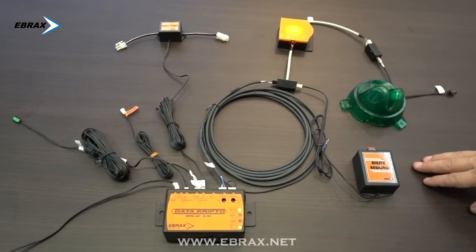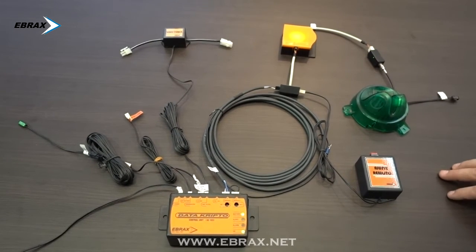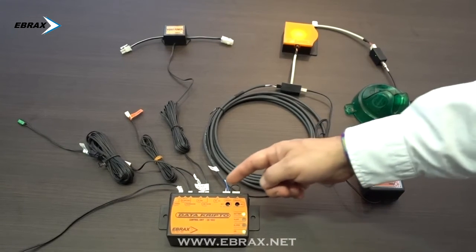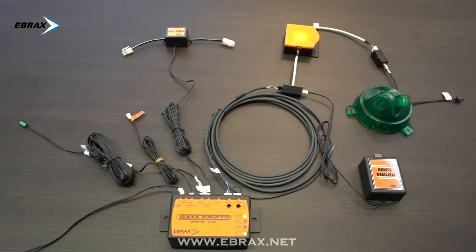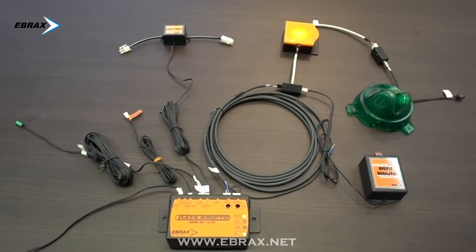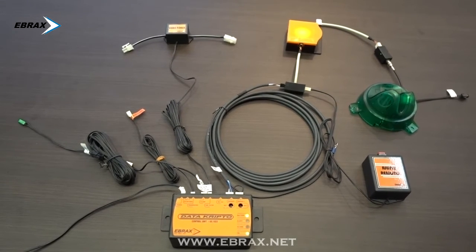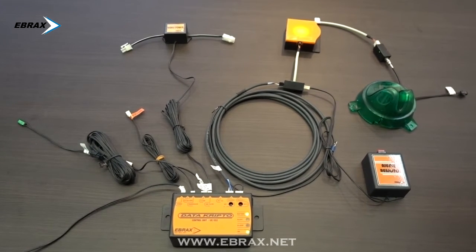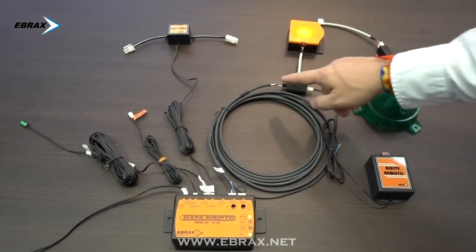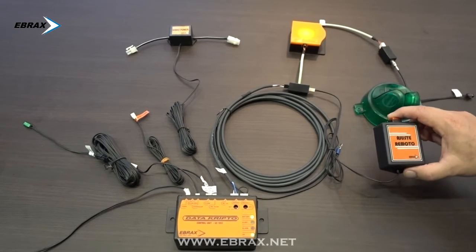We have another option if we want to calibrate the box when it is placed inside the ATM's chamber box and our mobile phone and software are not connected through an RJ45 wire to the chamber box. In this case, we can order the calibration through this small box that can be installed inside the ATM. This box is connected through a wire to this intervention system, and when we press the button, the calibration of COM1 is generated.